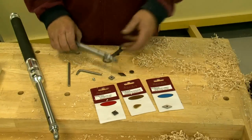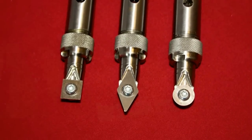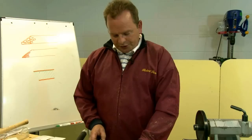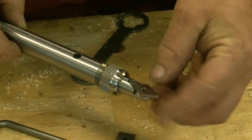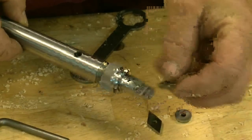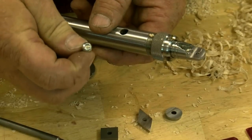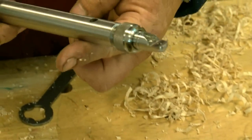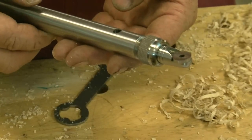Certainly. The unique cutting head is able to hold many different sizes and shapes of cutter. There are seven high-speed steel tips available, seven of the titanium nitride, and three of the tungsten carbide. All the cutters fit onto the unique head, held securely in place with the specific shape. These are all held in place with a high tensile Torx screw rather than a traditional Allen type screw. The other plus point to the tool, you probably notice that there's a flat on the back to keep the tool flat and level. This keeps the cutter, head and the tool in the same plane.